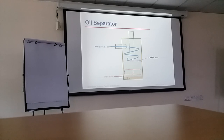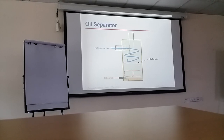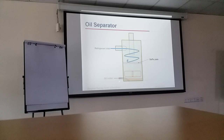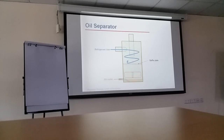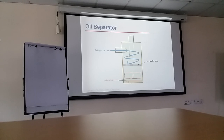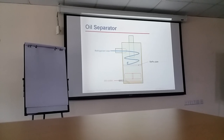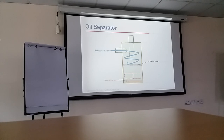So the baffle plate supports the refrigerant going back to the condensers, and due to the centrifugal force the oil will be on the surrounding walls. It will come to the bottom by gravity and then it goes to the outlet of the compressor for the filter side. We don't have anything else inside. This is just for reference — what exactly it is doing. You can explain this to your customer if somebody asks. This is just separation of the oil; that is the main function.